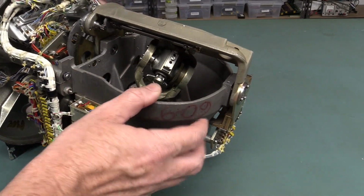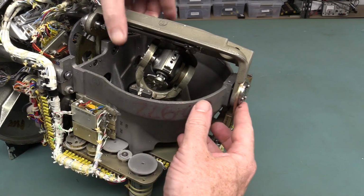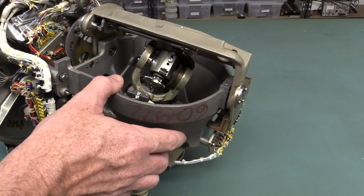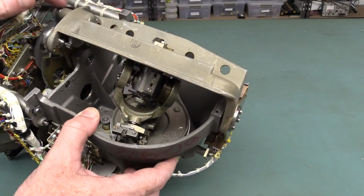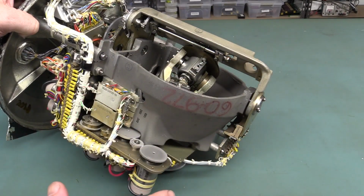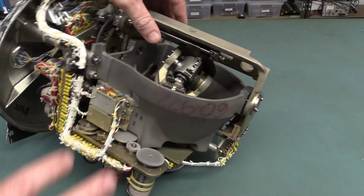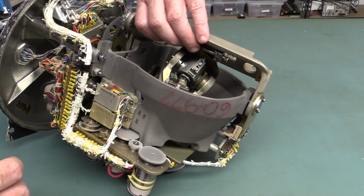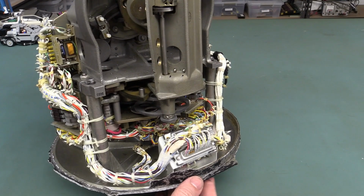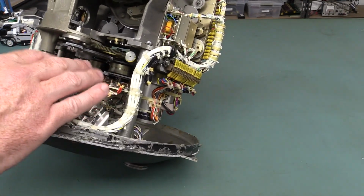And there's got to be another one which spins this whole top mechanism. This whole top bar is not fixed. It's on a bearing there and connected up to these cogs. So it all spins around in there like that, but it's not a gyroscope, as in it holds a reference frame for a moving object. All this stuff in here is designed to compute something using the cogs. I believe this is how it works, by the way. I am certainly no expert on mechanical analog computers, but all these cogs down in here are going to do all the computational stuff.